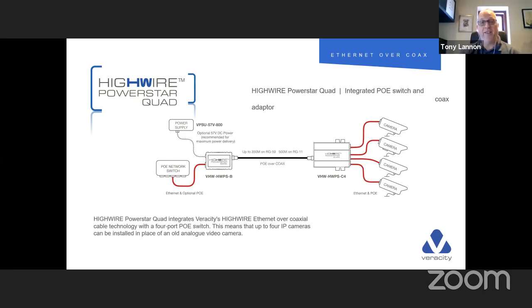That Quad unit is really handy. We get a lot of requests where customers have an existing system and want to add cameras at a location — but the work involved is normally quite extensive. A simple upgrade is to put this unit in and deploy more than one camera at that location with very little work, very little site time, and obviously decreased installation cost. We see this a lot where they used to have PTZ cameras on analog — they're putting IP cameras in and using this device to run to the same coax location and then deploy new IP cameras within 100 meters or further with other products.